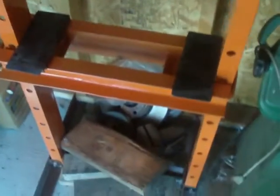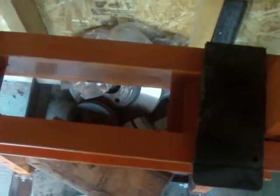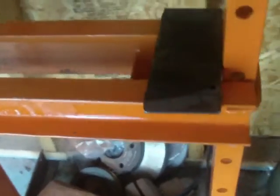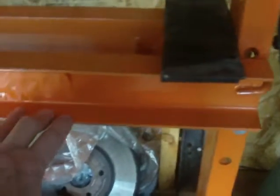The second thing I found is that the bed here is a little bit narrow, and sometimes when I'm pressing a bearing I find it a tight space. Often you're going to put your wheel hub or bearing hub from your car or truck on here, and it's a little bit hard to set and deal with. Also, in one application I actually bent the beam, so I turned it upside down to get my straight edge back — watch for that so you don't go bending it, because these aren't really heavy duty.